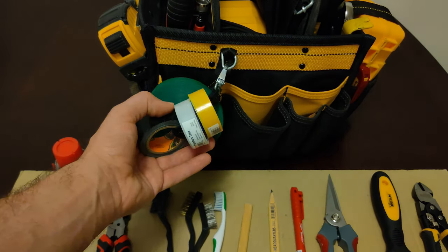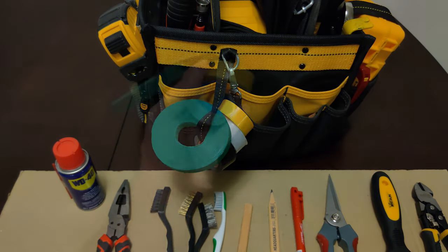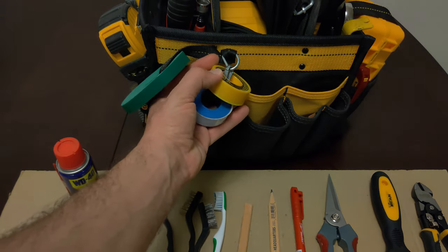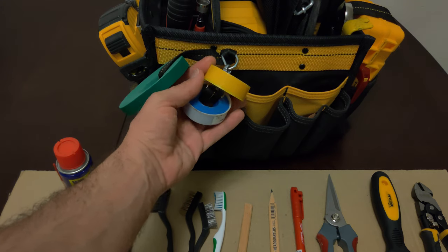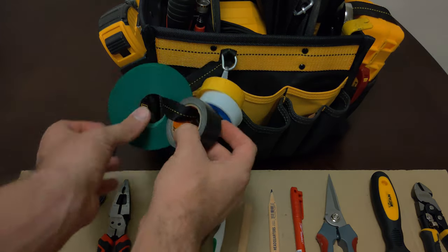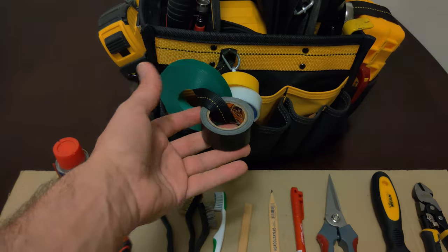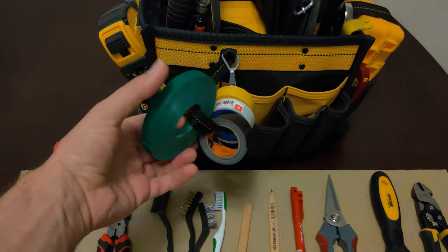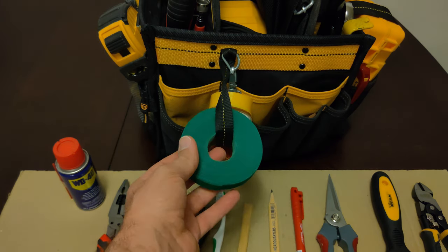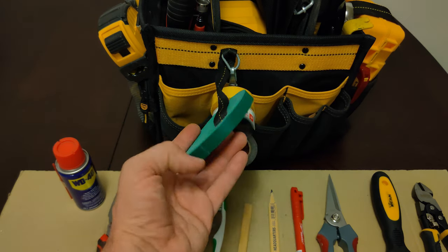Hanging here we have some Teflon tape, Gorilla tape, and some Velcro. I got two types of Teflon tape — yellow and white. The yellow tape is thicker and is used mainly on gas piping, and the white tape is not as thick and is usually used for water. The Gorilla tape is like a heavy-duty, all-purpose, all-weather tape that you can commonly find in home improvement stores. The Velcro is just for temporary bonding of things together like wiring and cables — it doesn't leave a sticky residue and unlike zip ties you don't need to cut them. They're just reusable.